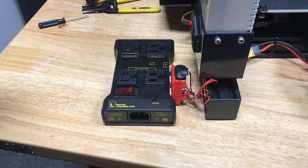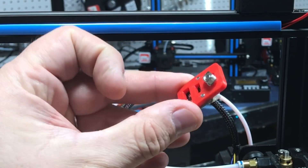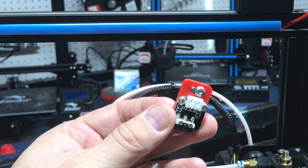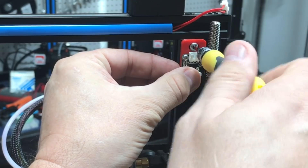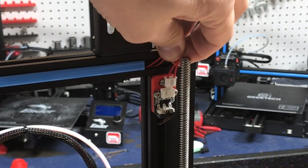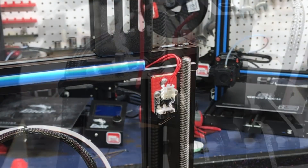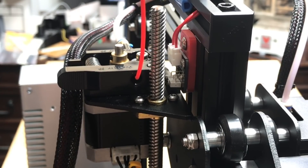Now we need to install the switch. This mount is a copy of the one on the CR-10 or CR-10 Mini — I found it on Thingiverse, printed it out, and it fits the switch perfectly. A couple of screws hold it to the plate and one T-nut holds it to the beam. I'll slide this in place all the way to the top and tighten that T-nut. This holds the switch just above the cross member as it comes to the top. I'll plug in the wires and then crank this up to make sure the switch makes good contact with the bracket that holds the extruder — and it does.